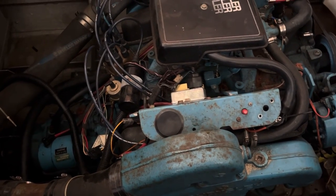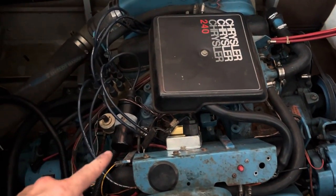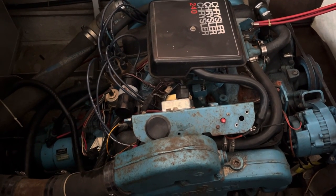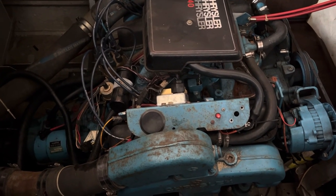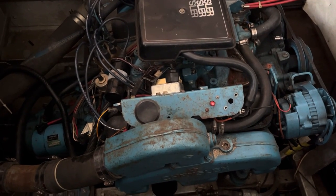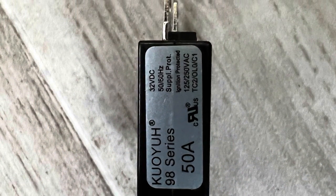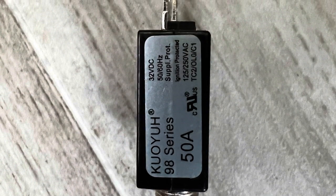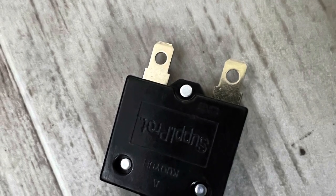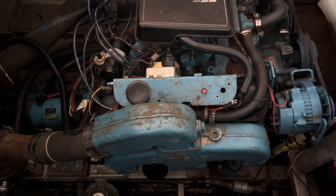What's the big deal, right? Here's the deal: if this engine's running and you've only got 10.5, 10.6, 10.7 volts — that's what I was getting — back to all your ignitions, your coil, your electronic ignitions, you're going to have low spark. Your spark plugs are not going to fire correctly and you're not going to have the output of your coil feeding your distributor. That's why it's so important to clean and check all your grounds — very, very important. I also need to order a new breaker to take care of that, and I'll check my starboard engine, and everything should be good.